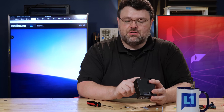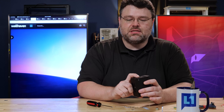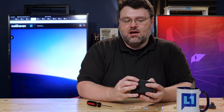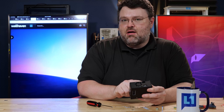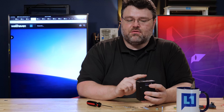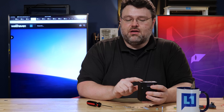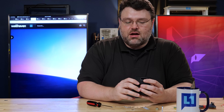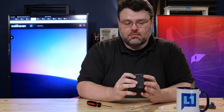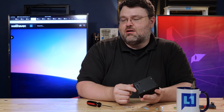This gives you your front panel connections and a serial console. You've got your USB on-the-go interface, your USB mouse and keyboard, and USB Type-A interface if you really need it. The HDMI — the micro HDMI — is still accessible so you can plug that in and get a console to the Raspberry Pi if you need to troubleshoot it. The USB 3 and USB 2 interfaces are still available, the regular Ethernet interface is unchanged, and you've got a red and green LED, plus the optional OLED screen.